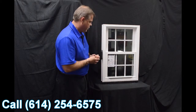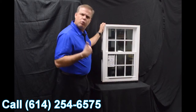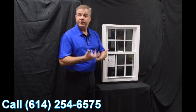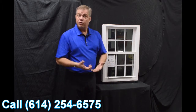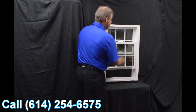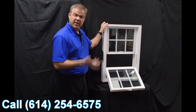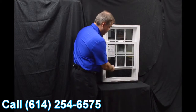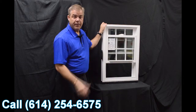One of the next features is the full-length lift rails that are extruded right into the sash — they're not snapped on, so there are no parts or pieces that are going to break off from the window. Again, this makes the window extremely strong and extremely durable. And then finally, we use the Serta constant force balance system in the window, and this is really the heartbeat of any window. When we engage that sash and lower and raise the window, it really is fingertip operation.